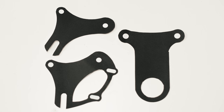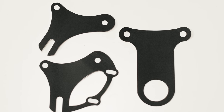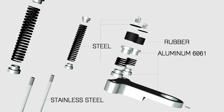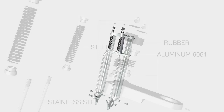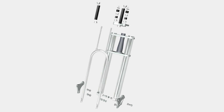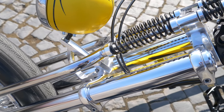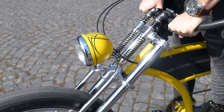The next step was to print all moving parts and use a PVC pipe as a prototype — unfortunately I have no pictures of that stage. Since all parts would be made of aluminum and cut with water jet CNC, I had to make sure all parts were well designed and working as they should. An error at this stage would increase the final production cost.